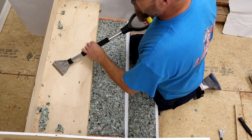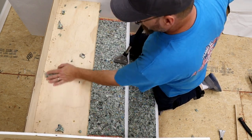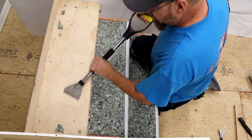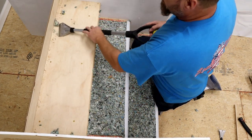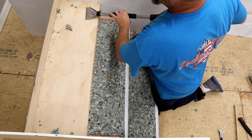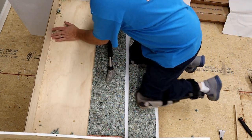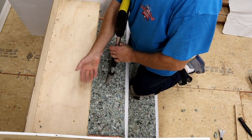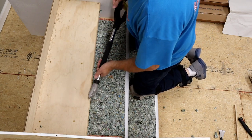And it's not rough to do whatsoever. So look at there. All of them right there are completely gone, okay? Have no staples left whatsoever. And again, I'm gonna go over the entire flat surface with this and even what I can do on the nose of this with this scraper, because this is the fastest and most efficient way to do this little job right here, okay? If you're doing one staple at a time by hand, it takes time and it will get sore on your hand right here, okay? So the more you can do with this scraper, the better off you're gonna be, okay?